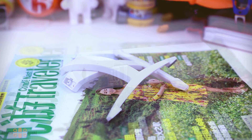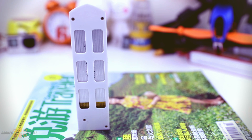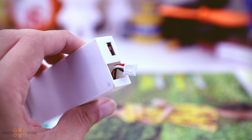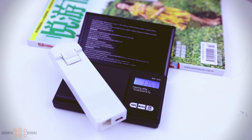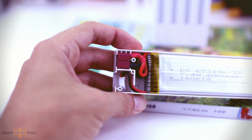The landing gear is very simple and light — each leg attaches to the body through two screws, which are included. Then we have the battery, which comes protected in a plastic housing making it easier to insert in the aircraft. On one side you can see the battery inside, and on the other end there are two connectors: one is the balance port and the other is the connector that supplies the quadcopter. According to my scale the battery weighs 116 grams. Looking inside, this is a 2S battery with a capacity of 2000 milliamps, with a female Deans connector, and it should take roughly an hour to charge.